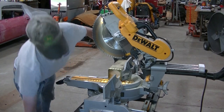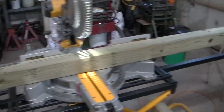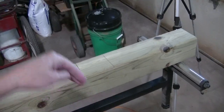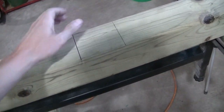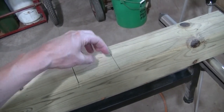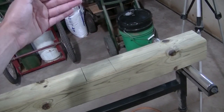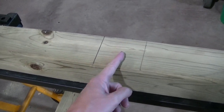The main length cut looks right. Now I got to figure out where the mailbox is going. The bottom of the mailbox goes right here, so I need to make a cross piece that'll set the mailbox on, and then there'll be another support coming off of that. To get another 4x4 across here, I got to cut out half of this — a 4x4 is three and a half inches, so I got to cut halfway into the board.